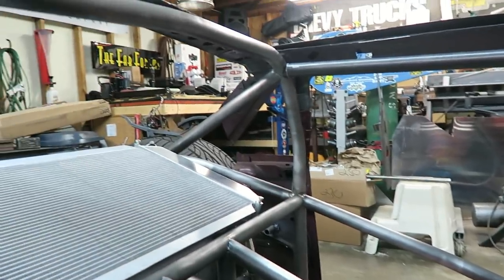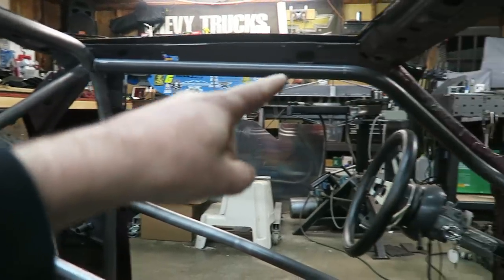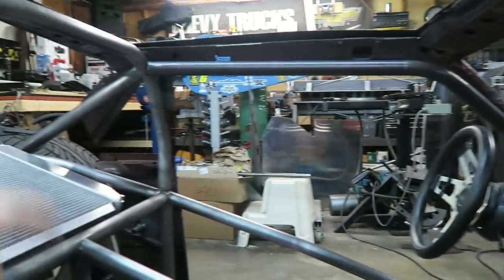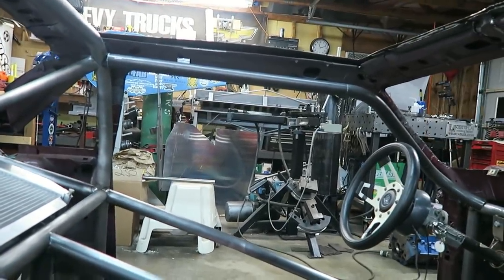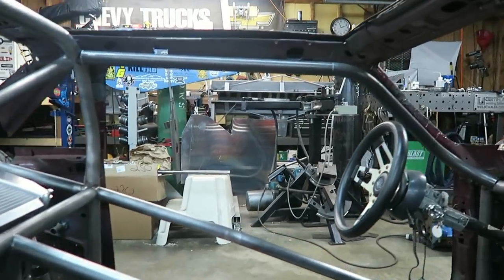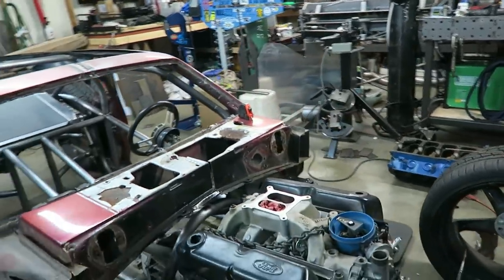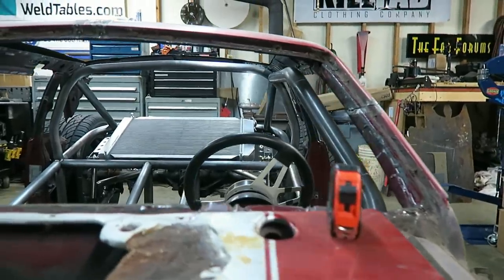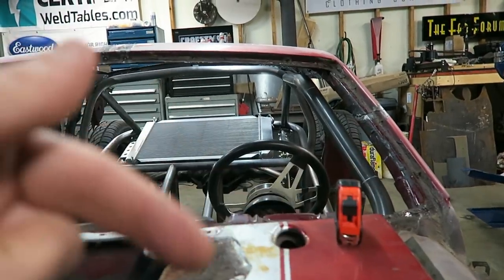All right, so the other thing is, if you follow me on social media, you've seen where I've bent and notched this A-pillar bar. So this thing just comes down, ties into this front bar. Pretty standard setup for a 10-point cage. And then usually you just come in here and put a crossbar across the front. Turned out pretty good. I'm pretty happy with how the notching turned out, because it's multiple bends on several different planes. So you can see it comes forward and bends this way, and then bends into the chassis that way. So I really like how it turned out.